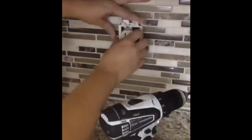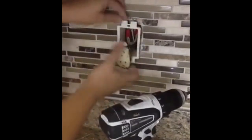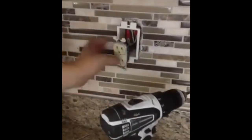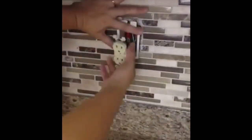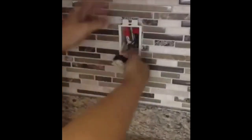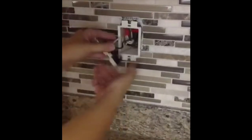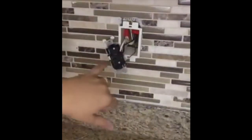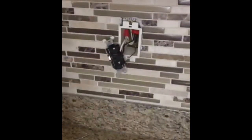Okay, so this is my outlet and this is the outlet extender — the actual box is back in there. So if you're doing it in drywall, all your work will be in the box. You're going to pull it out — try not to pull it too hard, but you'll need to pull firmly. So you have two live wires — they're black and white — and then you have a ground wire that's copper. This is a quick connect outlet, so they're just stuck in the back without being wound around a screw.